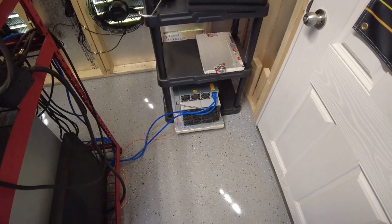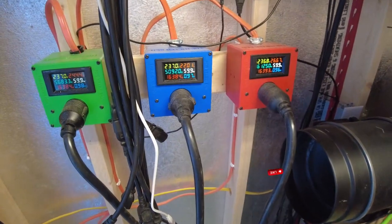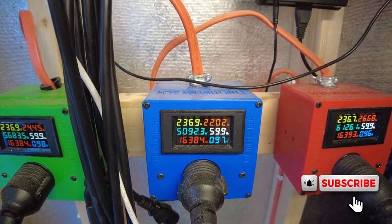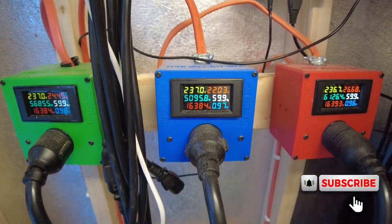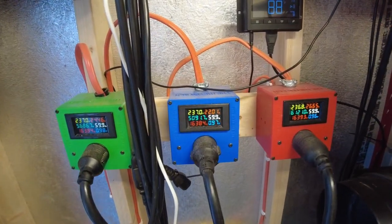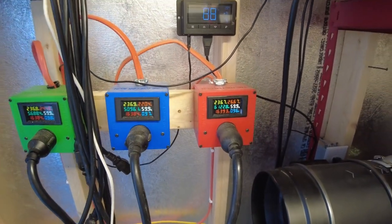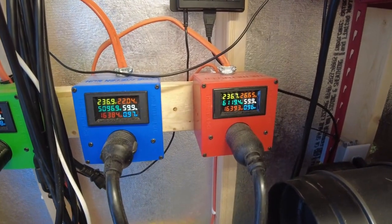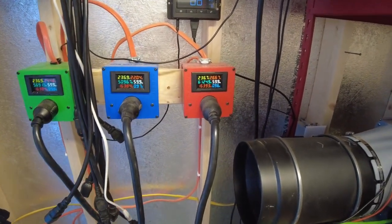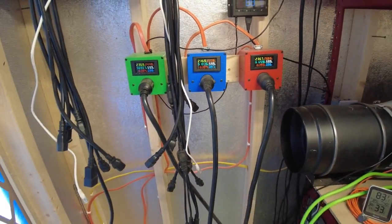Alright, she's up and running. It's only been going for a couple of minutes. We'll check where we are at — full power. I'll hop on the computer when we go inside and see. But we're pulling 5,093 watts off this breaker. It was just under 3,000 — like 2,900 and some — before. So the red breaker is a little over, because I switched the one 3070 rig that's on that breaker — it's dual mining Ethereum and Ironfish — over to the 24-amp rail. So I'm going to move it over on that; I might have to move an Ethereum rig over to the blue one.